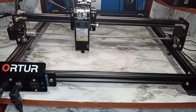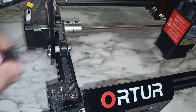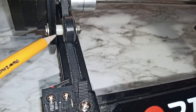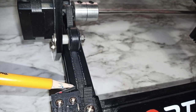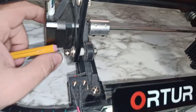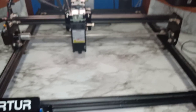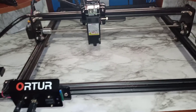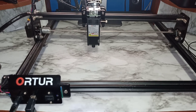I hope this answers everything. For the homing issue, you can add that piece of plastic — or glue a small piece of wood or plastic to the frame — just to make sure you're hitting the limit switch before the laser base or lens hits the rail. That should fix your homing issues. Please let me know if you need anything else, and I apologize again for the English. Leave a comment if you don't understand something and I'll try my best to answer. Have a nice day!